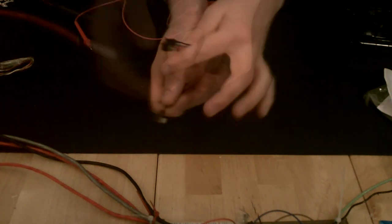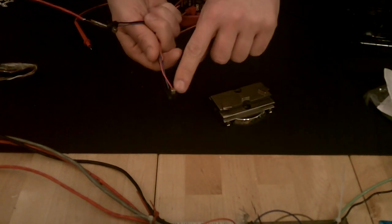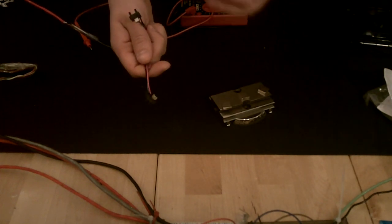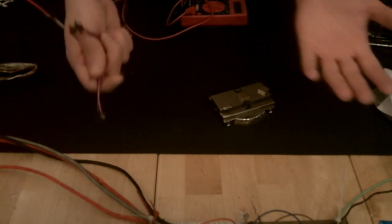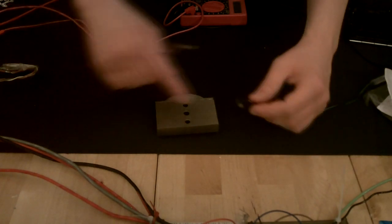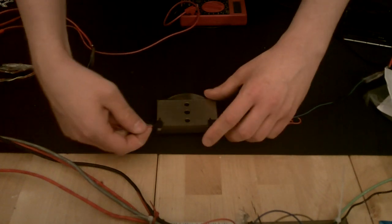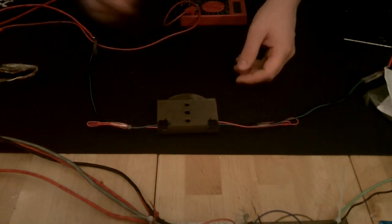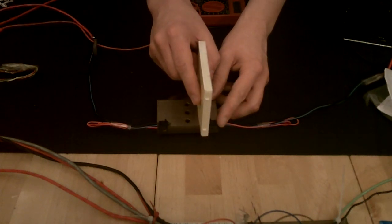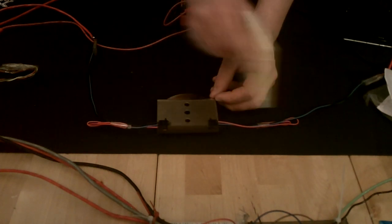Click, click, click, click. The best part, or I think the most ingenious part, about these limit switches: I affixed rare earth magnets to the back of each switch. I got the idea originally for a CNC machine I was working on, but with CNC, you cut a lot of ferrous metal, and it's just going to stick to the magnet, and I didn't want that. So what would happen is, let's just say this is the distance you want to travel, and you want to keep it in there. So you'd attach one there, one here, so then as a platform would move one way, it would click, move the other way, click the other way, and so forth. That way it'll stop it from going too far one way or the other.